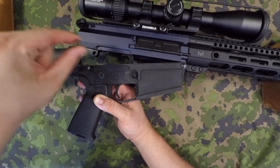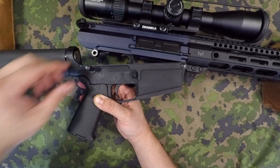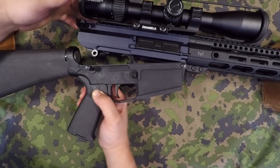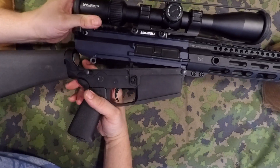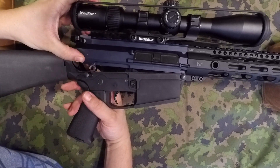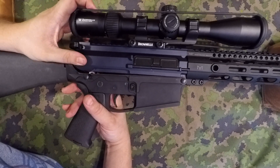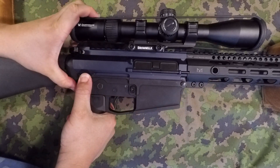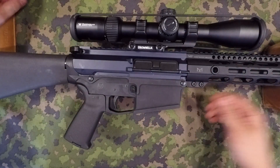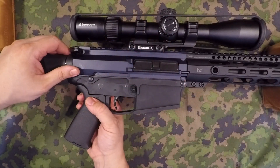You can see they're not affixed at all. Just two red shims. They go right down on there. The grease just gives them a little bit of surface tension, so then I can close this up without dragging the upper and the lower. Most often, they line up just perfect. Sometimes I'll do it whenever the rifle's upright — it's the same way. There's really no trick behind it. You just pop your pin out.